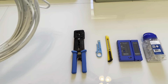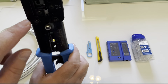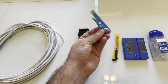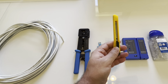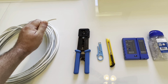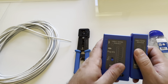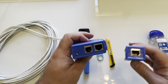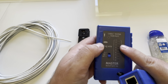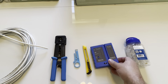What you're going to need for this project is a piece of cable — I've already pre-cut this piece here. You'll need a crimper; this one's nice because it's got a blade on it and does multiple types of connectors, so you can do RJ11 or RJ45, which is ethernet. Other helpful tools are a wire stripper, an X-Acto knife, or some sort of sharp knife — handy if you want to nick the jacket and peel it back. A network cable tester is also useful; they've got LEDs, they slide apart, and can test RJ45 or RJ11 cables, testing the continuity between each of the wires inside the cable. That's a good way to make sure your cable is good before you run it through the wall.